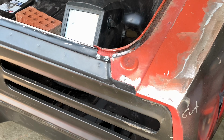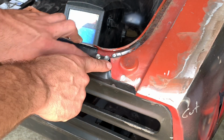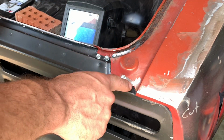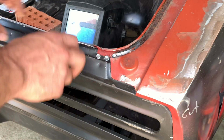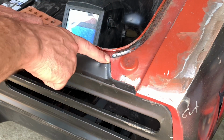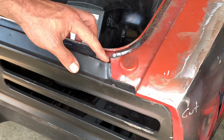I guess I was figuring part of the thing you want to see is maybe how to weld this corner in. I patched up all the spots where I nicked it when I cut it out, so that's all gooder now. So I'm going to come through here now and put one here, here, here, and I'll do those three. It's basically 6 spot welds through here, and coming to find out, all the repop panels, what I've heard back on my feedback is they all kind of have this crummy gap here.